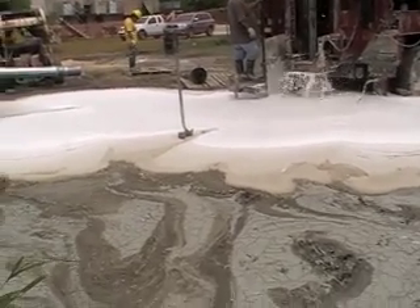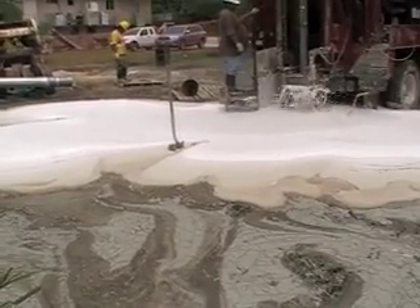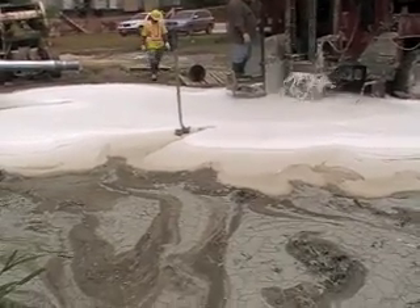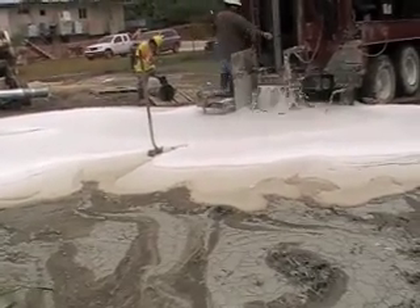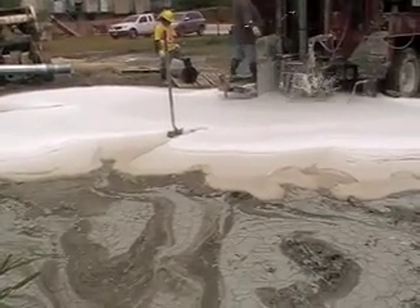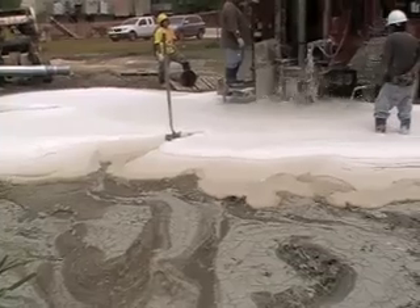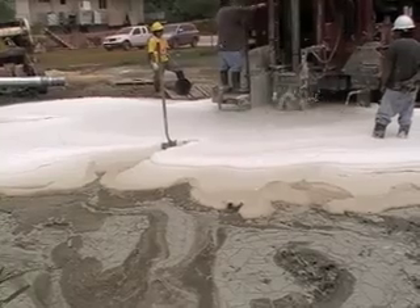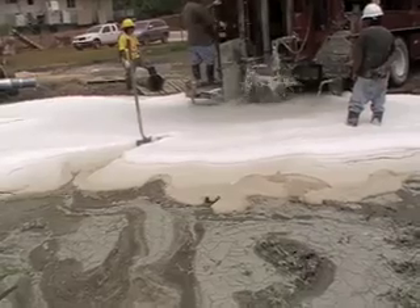Once this drilling is complete, they pull out the rig, they drop the ground anode in, and then they move on to the next hole. Now, before they pull out anything else and before they do any of the splicing, the next step is they're going to dig approximately a one to two meter trench between each hole all the way over to the beach manhole. When they do that, that is when they're going to splice. They're going to run conduits and splice all of these anodes together.